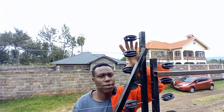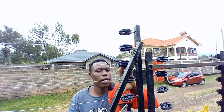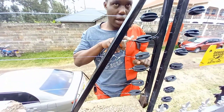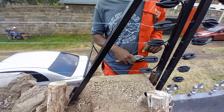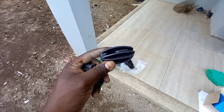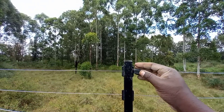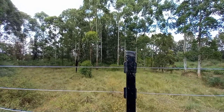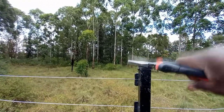You have to discuss with the client you are doing the job with so that you don't create a short. These are called isolators, and these are called top covers, which you cover up here like that. You have to do the looping for the job to look neat and to avoid water getting inside these poles.